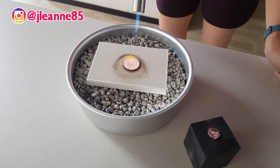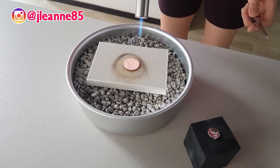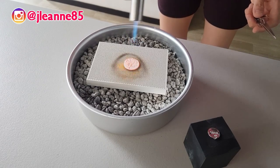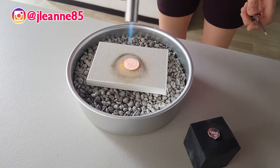We're waiting for the piece to go salmon red or salmon pink. So after a few minutes of firing it continuously, you just have to be very patient at this stage because this is very very important. From the time that it flames up up to the time that it goes red or salmon red, that's the time that this piece is actually forming into a pure compacted fully sintered fine silver. You can see that it's changing colors, and as soon as I get that salmon red color...